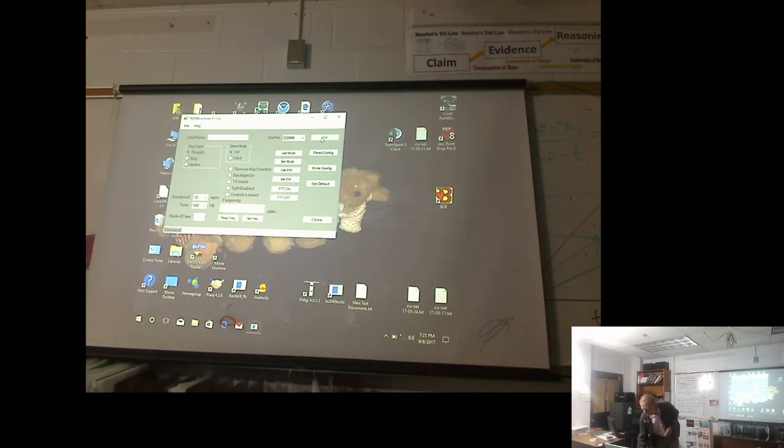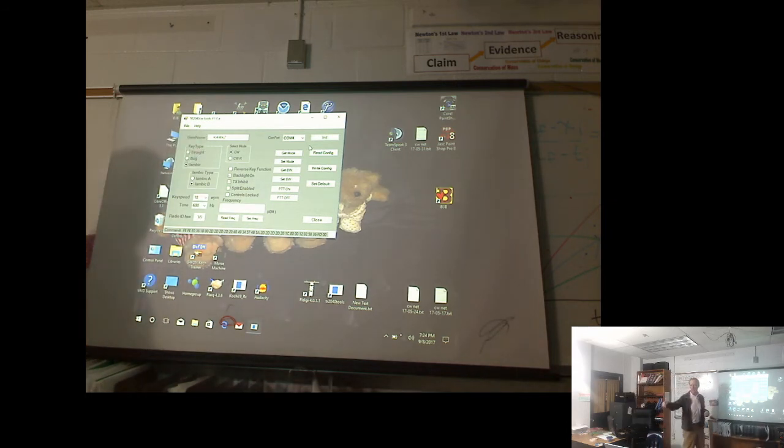But anyway, let me see if I can read the configuration from the radio. And what it did, it read the configuration. I've got my username coded in, which actually appears on the front panel. It's set up, in this case, for the iambic B key, so I can use a paddle key with it. I can set the key speed to several different levels that I might want to operate on. I have a whole variety of key speeds that I can select.